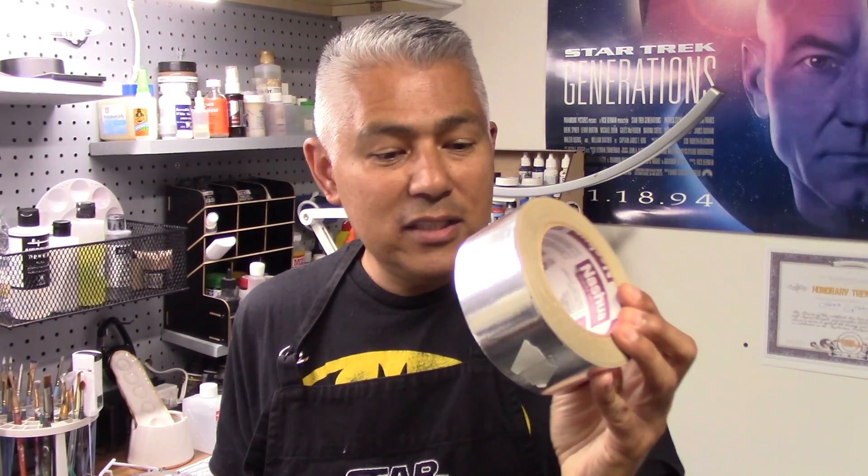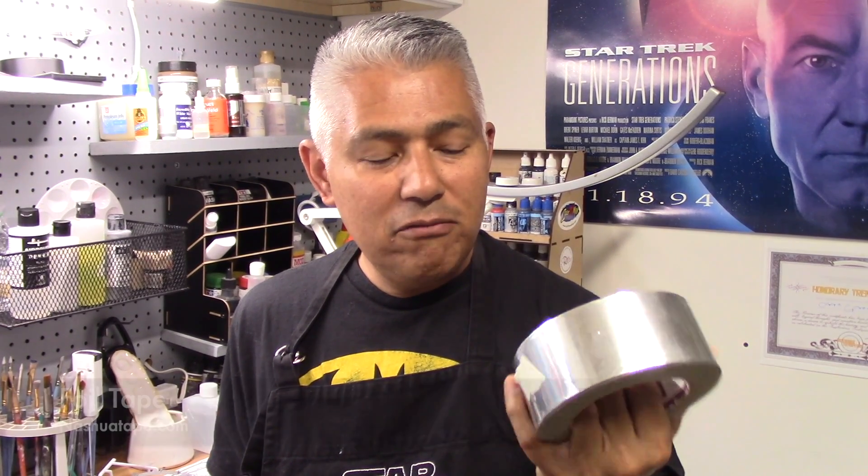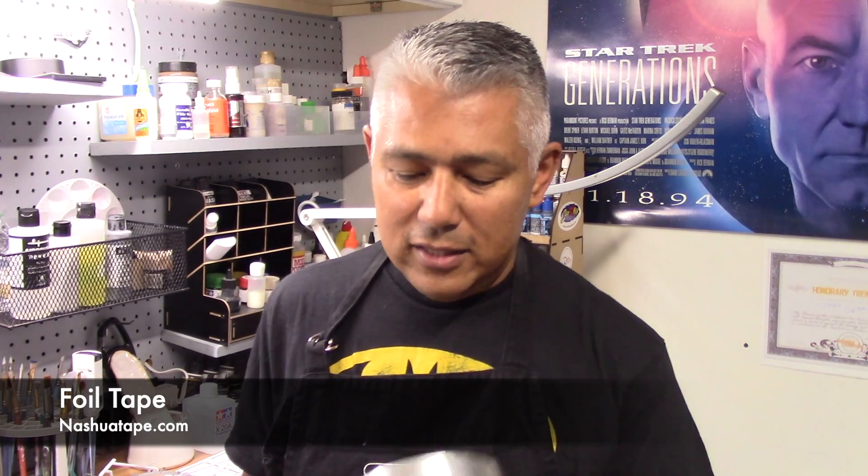This foil tape is from NashuaTape.com, available at Home Depot — typically used for vent connections for dryers and heating and air conditioning. I've followed the method of taping down the wire before gluing the SMD to whatever I'm connecting it to. It helps hold everything down while gluing and also creates a stress point so you're not yanking on the connection between the wires and the LED. I'd highly recommend this over masking tape because it has a very strong adhesive and conforms to anything you're taping it to, keeping the wire from moving around.